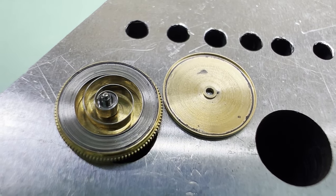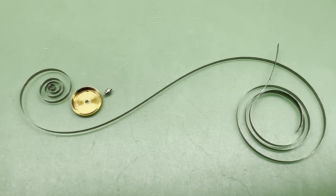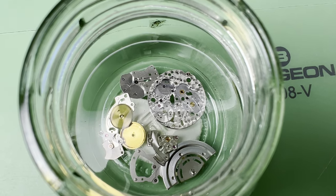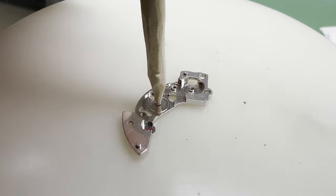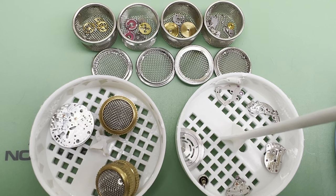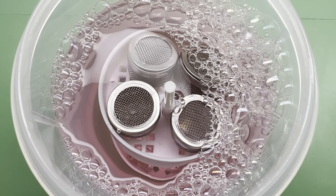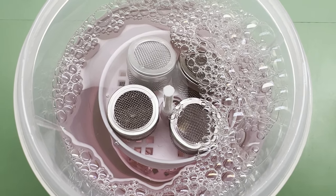The final thing to do before cleaning the movement is to remove the mainspring from the going barrel. It's in okay shape, but a new mainspring will help performance, so we'll do that. With the movement entirely disassembled, it is time to start the pre-cleaning. The larger and dirtier components are rinsed and brushed with isopropyl alcohol to remove the bulk of the dirt, and the pivot holes are pegged out. The small components are placed in a basket and dipped in isopropyl alcohol. After they dried, the whole lot are placed into a solution of watch cleaning fluid — Elma Red 1-9 concentrate with deionised water — and the container is placed in the ultrasonic cleaning machine for 10 minutes.